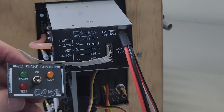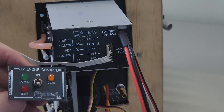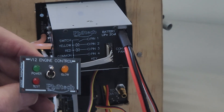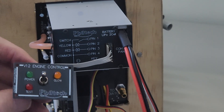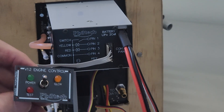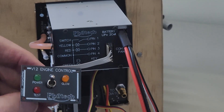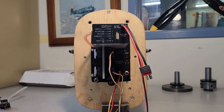In other words, the battery can be connected in the hangar well before proceeding to the airstrip. When the switch is turned on, the system moves through a checklist which includes checking the condition of the glow plugs, fuel pump pressure, and coolant pump operation. If all are found to be okay, the green light comes on, which indicates you are ready to start cranking the engine.